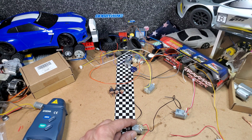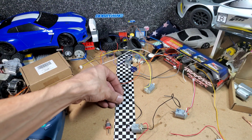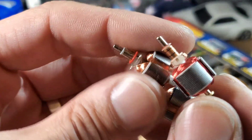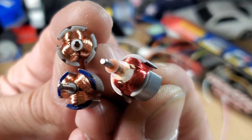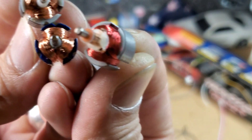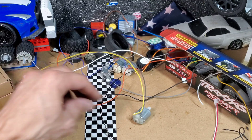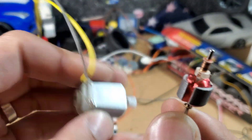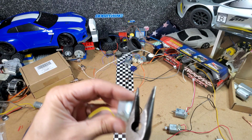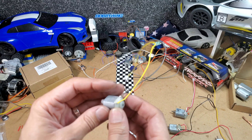I've already bought some copper enameled winding wire — what they call magnet motor wiring or motor rotor winding. I've gone through a couple of rotors in different variations and colors, possibly for temperature reasons. There's definitely different turn counts since some have more copper. I've selected two armatures to take the windings off of and rewind to a different, much lower turn count.